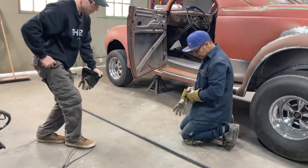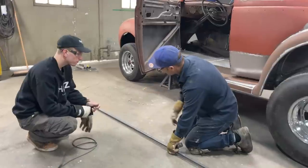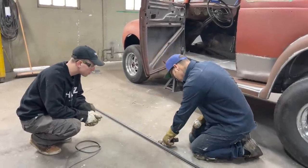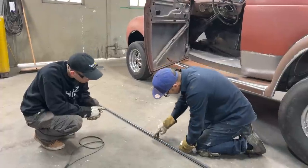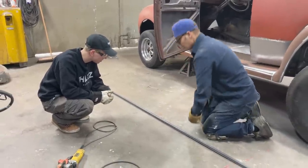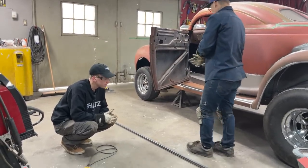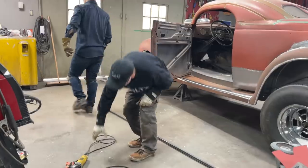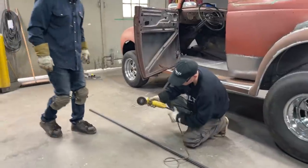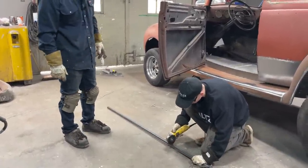Well, generally, what I like to do is hold the long end up, and let that piece fall if you're cutting that, you know what I mean? If you hold it like this, we got a gap going there. You start cutting it on the floor and that goes down, it'll jam up your zip cut, if you know what I'm trying to tell you. So you hold whatever one you're holding, hold it up and let the other piece fall off. Go for it. Cut her off, man. So that's how I would do that. I would hold that up and let her cut off and fall.